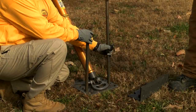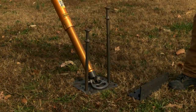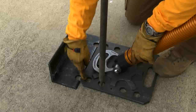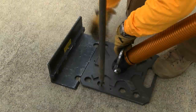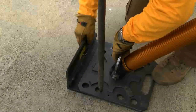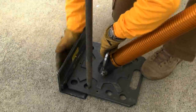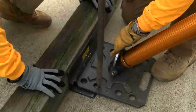Pin it with two pickets, which is normally the way we start. We can always add a whaler system to the back later. If a wooden raker is assembled next to this system, it can be braced to the ground using a whaler — this flexibility is designed into the system. We always place our pickets in the second hole from the back so that if a wooden whaler is used afterwards with a wooden raker, they can slide in the angle brace and fit it right around the picket. Now slide in the whaler against it so the base plate cannot kick out under the whaler.